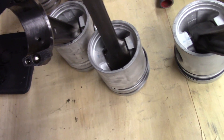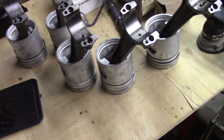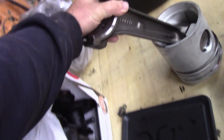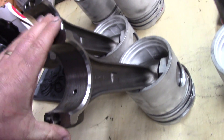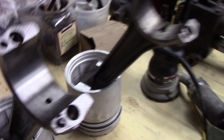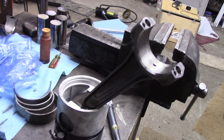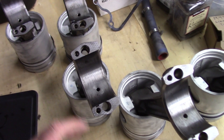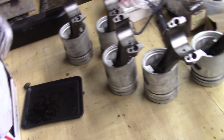I bought this truck directly from the US government, so it didn't pass through private hands or some heavy equipment shop, but somehow this truck ended up with all big cam rods. When we were pulling it apart I noticed I had three rods of one marking and serial number, and three rods of another marking — one set marked B-J-Y-K-H-T and the other R-E-C-L-Z, plus different number codes. They're slightly different colors. It must be a mix-and-match part motor, and it had to have been done in the motor pool.